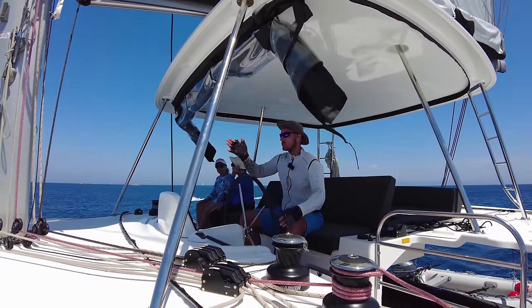So now this is how you should do it. He dropped the anchor all the way on this side and he's gonna put a line on the other side, and that's how you should do it. Now he's going back too fast, see? So he just did a small mistake because the anchor chain doesn't go out as quick as he's going backwards. So he might be already dragging the anchor.